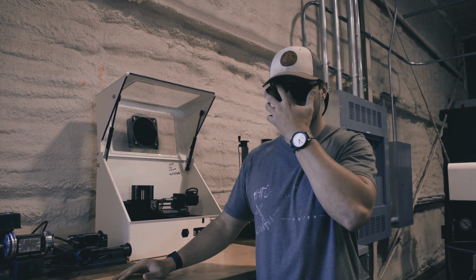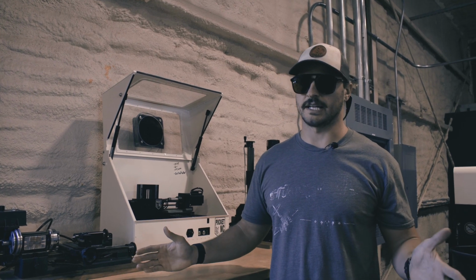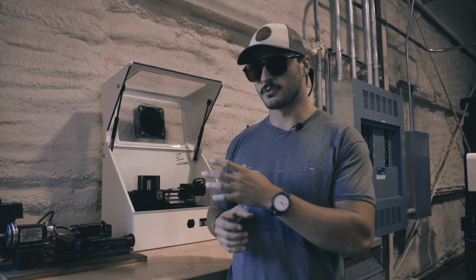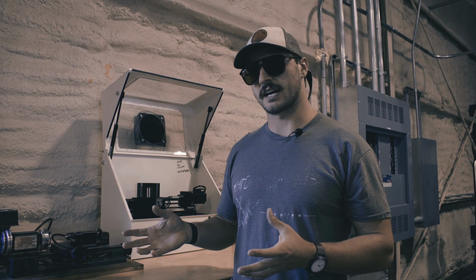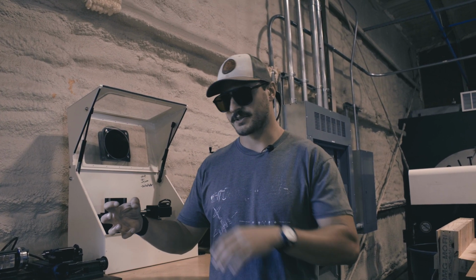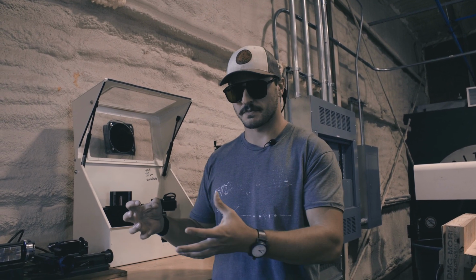Some of the fancier lathes they call mill turn centers. If you ever hear of a mill turn machine, they're actually somewhere between a lathe and a mill. They'll have a milling spindle that can come in just like the mills that we have that can change tools and do everything that those machines have, but they can also spin the material, and they can also have a sub-spindle. So they can start parts on the main spindle, come in with a milling head, mill, come in with a turning turret and turn it, and then transfer it to the sub-spindle, mill with a head, and then come in with a turret and turn it more and finish parts.